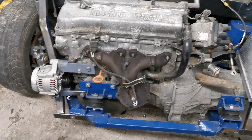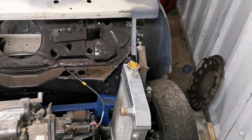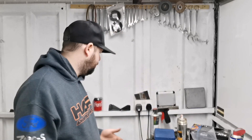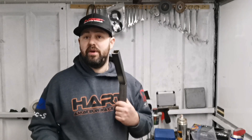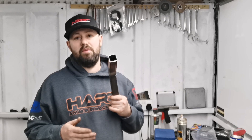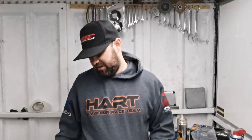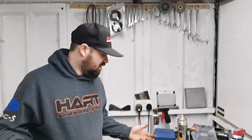That is two brace bars, made by me, and a lot of help from Pete as well. Like I say, it's using one piece — not tubular steel, box section steel. Because tube is a circle and this is square, it's box section. Both items are made from one piece. The tab's welded at the front. I'm fairly happy with them, they do what I need to do. The one next to the radiator is going to incorporate some sort of radiator mount, but we'll go through that next episode. Hopefully that was a bit interesting for you — it's something new that I've learned. I've never done that sort of thing before, but I'm really enjoying this fabrication work.